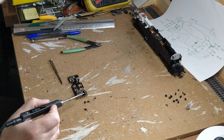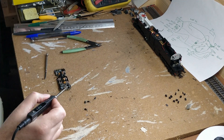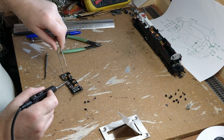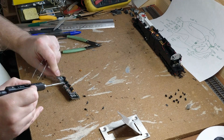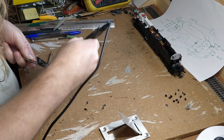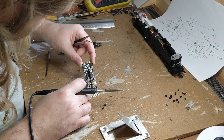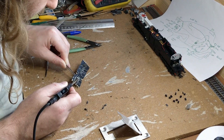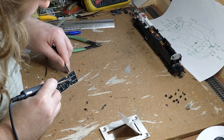Then if I connect the wires to the LED the other way round, it should work. I've decided to remove all the transistors, diodes and capacitors. There are also some resistors that could probably go too — they were used to limit the transistor base current before — but I'm not going to bother removing them yet as they will be fully disconnected from everything in this installation. You've seen me make an absolute hash of removing components from a PCB previously, so I'll take the camera battery dying here as a sign that you didn't need to see this again, and we'll jump to the modified circuit board.